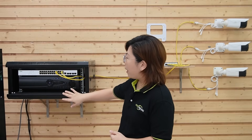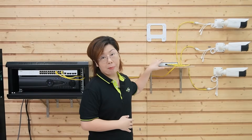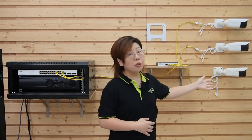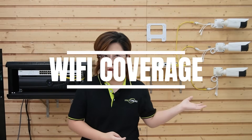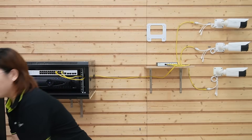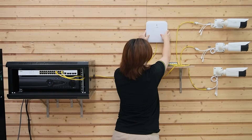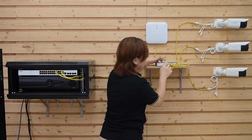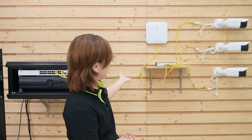We're looking at the main switch providing both power and data to each floor's PoE power switch, which then shares power and data to all connected devices. We also forgot something — our client wants Wi-Fi on each floor. So let's add our access point. The access point is 15 watts each, and our PoE power switch has a 65-watt maximum draw, so it's still enough power.